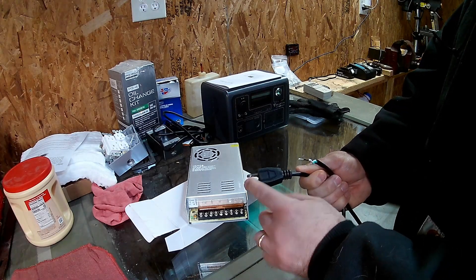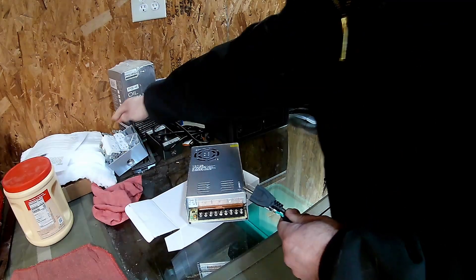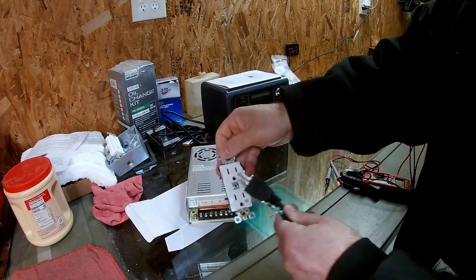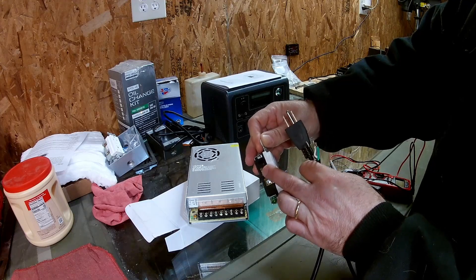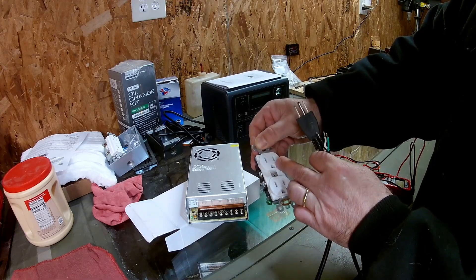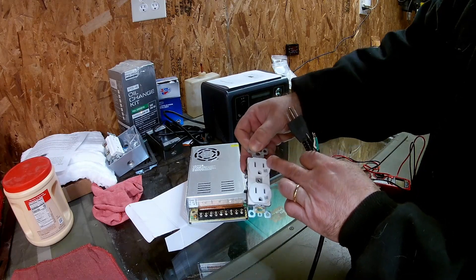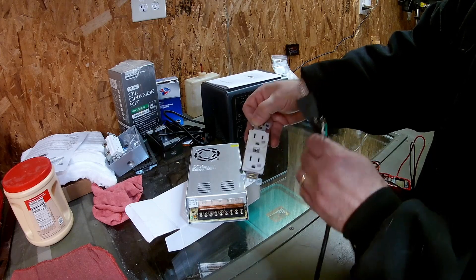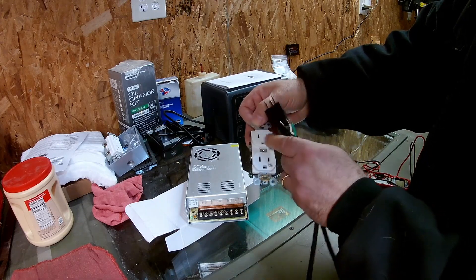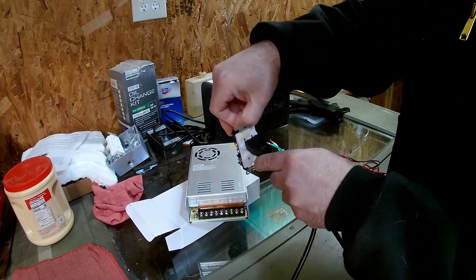This is the return — the left side. If you look at a power outlet, I just happen to have one over here: the wider of the two slots on the left side goes to the silver terminal, which is white in the wall, and that is your return. Black goes to the gold side on the right — the smaller of the two. Your ground is the one at the bottom.